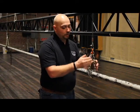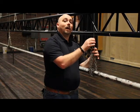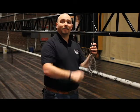So it's really important to know that if you need to replace a trim chain, don't just go down to the hardware store — dig through the code, find out what it is you need, and get the appropriate stuff. Your trim chain attaches the batten, which then shackles to the lift line, and the lift line goes upstairs, which will be our next stop.